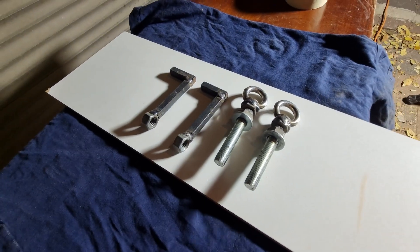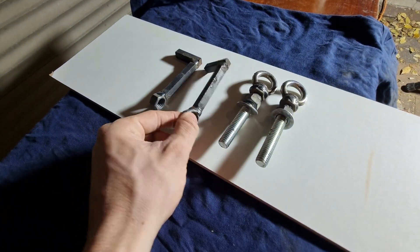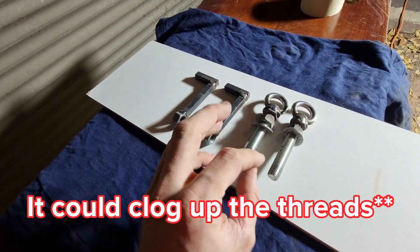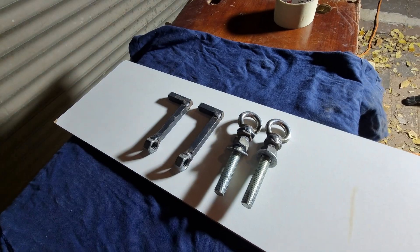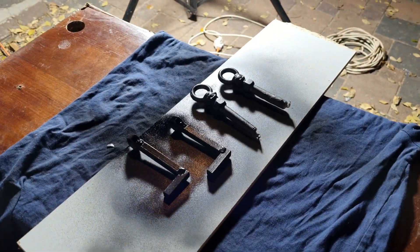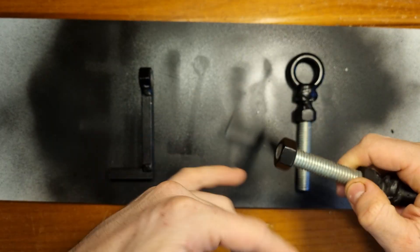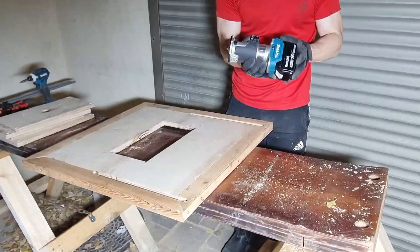These are the four pieces we're going to be painting. First, we need to take the washers off, and while putting the painter's tape on all the places with inserts and threads — otherwise the black paint would just rub away when you use it. Only certain parts are going to be painted black. Now we'll let them dry, flip them around, and do a second coat. The two parts fit together, thread still works — good. I rounded all the sharp corners with the router because it looks and feels nicer.